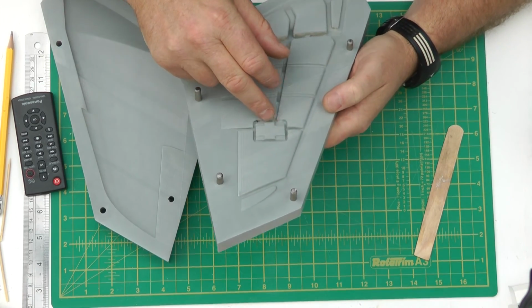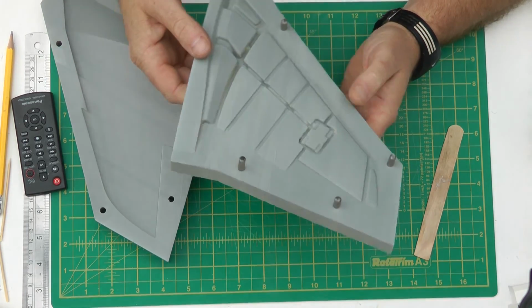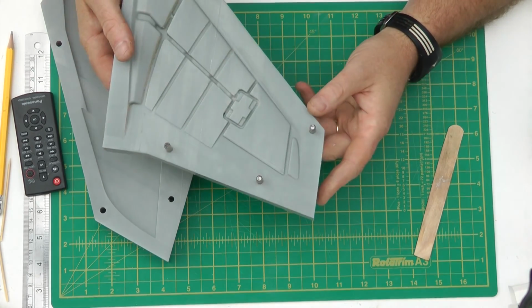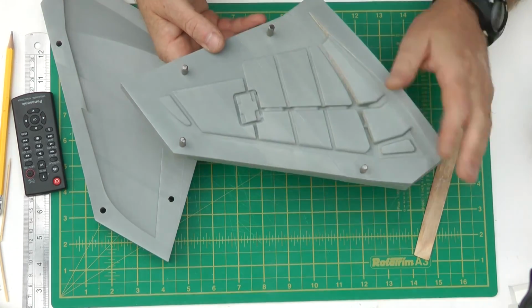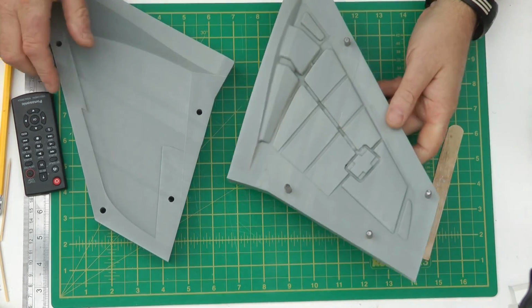I really dropped some candle wax in there again, sort of melted it in and worked it into any cavities I could see. I've gone sort of overboard with the release in there as well, given it all a couple of coats. So I'm hoping that the second pull will go as good as, or even better than, the first one.